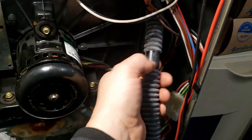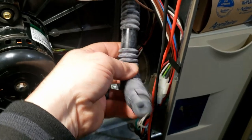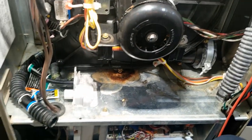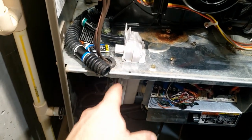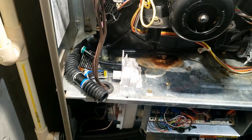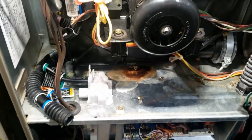Here's a little trick I'll use: I'll cut this thing about right here, move this plug to there. Then that hose gives me something to use to get down in here and blow through these. Now the best way to clean this thing out, obviously, is to take these clamps off and wash it out in the sink. But if you have one that's glued, you can blow it out with a hose or a CO2 cartridge works kind of good too. But flushing it with water is the best thing - shaking it and cleaning it all out.